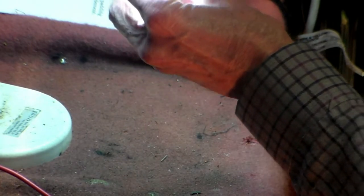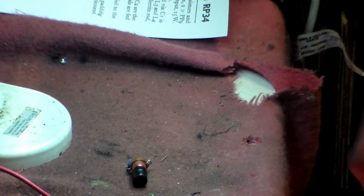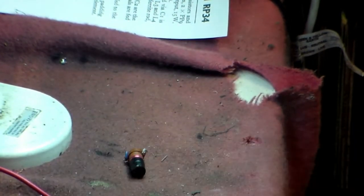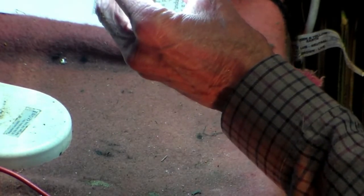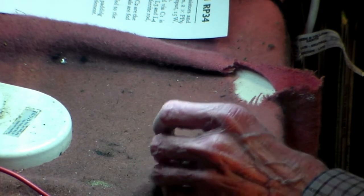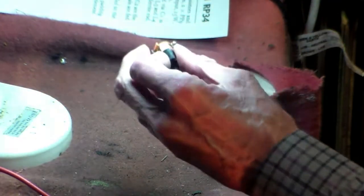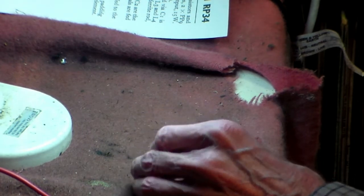Now, usually with these sort of problems, there are three ways you can deal with it. Well, four. One is a long wave set only. Possible, but not really. Wait for an identical antenna coil to come in. The other way is to completely rewind it, which we do sometimes, but in this case, most of the problems you get with these coils are with the connections, without fail. Looking under the microscope, I found that one end was off, and that was probably the problem.